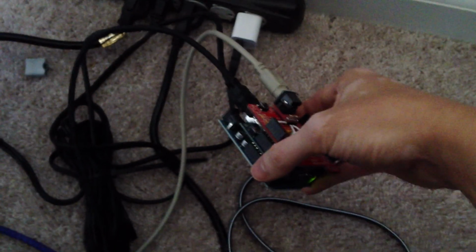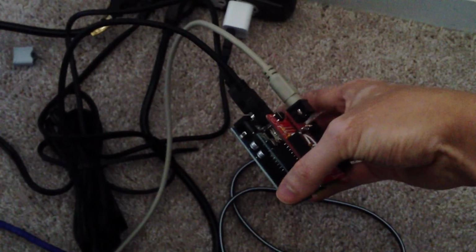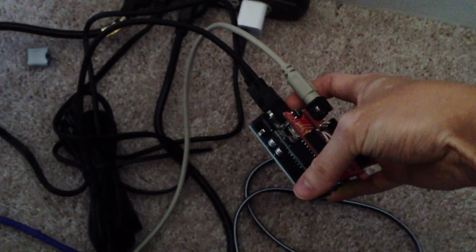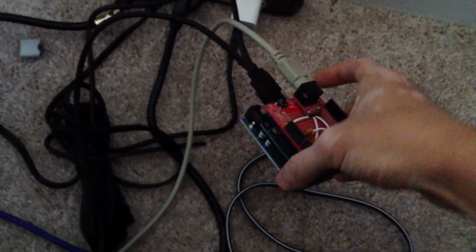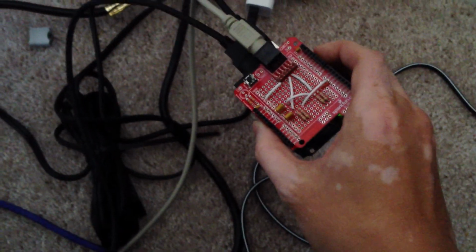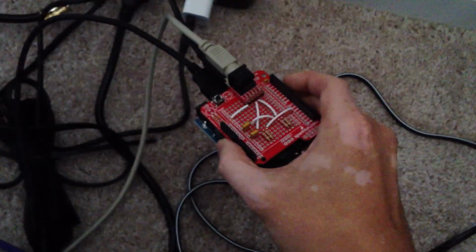So the last part of this is, now that I've got a library and code to load up the Arduino, power it up with this cable, plug the joystick in, and actually read the outputs. Now you have the third piece, which is this custom shield I made on top that is actually connecting to the Fanatec wheel right here with a PS2 cable.